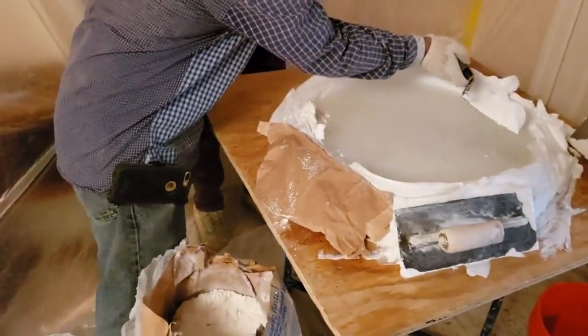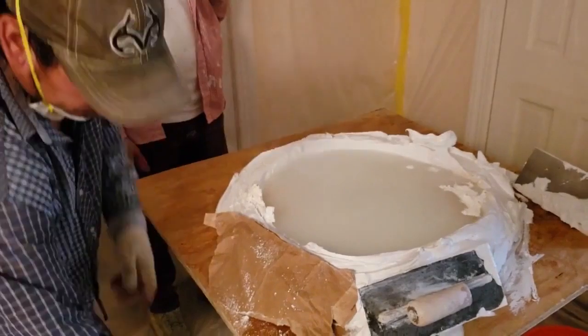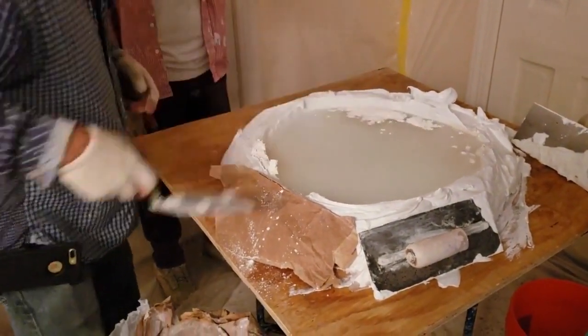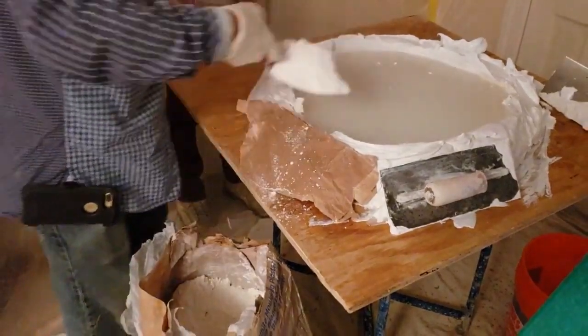For finishing over brown mortar, yes, we want to take really good steps to ensure that the mortar is not all lumpy. But making a patch, we aren't that picky. We just want to fill a deep hole and fill it fast — we want mortar that sets fast. We usually fill a big patch or even a ceiling in the same day.